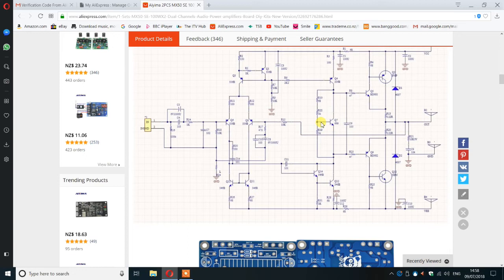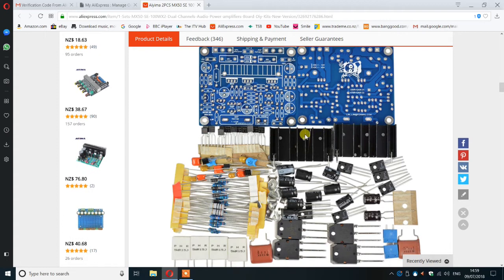Looking at the circuit, it looks pretty good insofar as it has the right ingredients for a class AB amplifier. One odd thing is that it doesn't have any adjustments — theoretically with equal plus and minus voltages the center point should be near center anyway. There's no quiescent current adjustment either, which initially worried me because I couldn't see how you'd get quiescent current at 30 milliamps across different supply voltages.